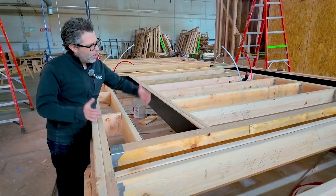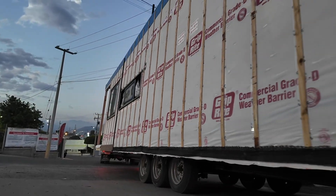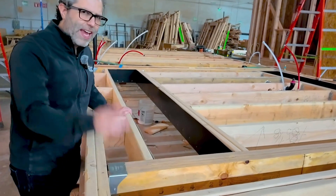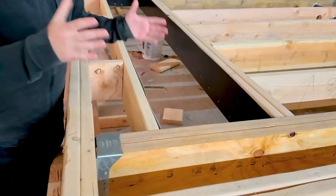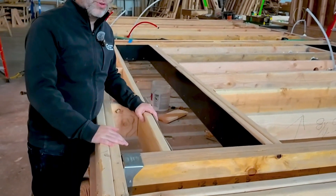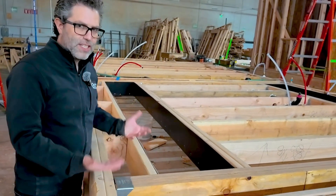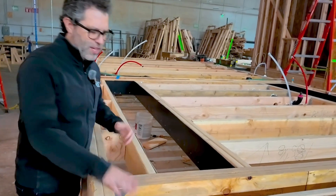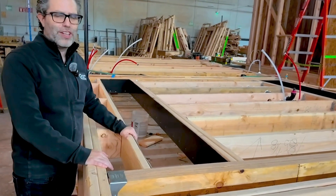The wheels being inset like this makes it easier for the wheels and axles to fit on the road. You might also notice these big support LVLs and, if you're familiar with construction, these upside-down brackets. This is part of our design to allow the trailer to be easily removed from the home. These LVLs — there are a few of them along it — are designed to support the home so you can unhook the trailer. It's connected with some bolts. You can jack up on these jack points, which will completely support the weight of the home, and then pull the trailer out.